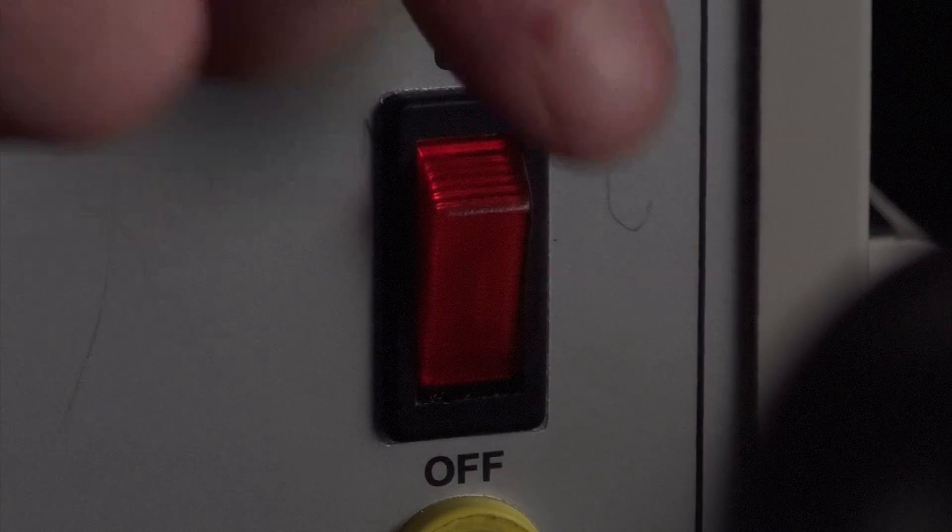What you'll want to do is turn on the power supply, get it to about 5,000 volts, charge up the parallel plate capacitor, discharge into the coulomb meter, and read off the reading. You're going to do this several times in succession. Make sure that you can get nice repeatable results, because we're going to be analyzing the charge that we got on the capacitor and the voltage that we've applied in order to calculate what is the capacitance of this capacitor.